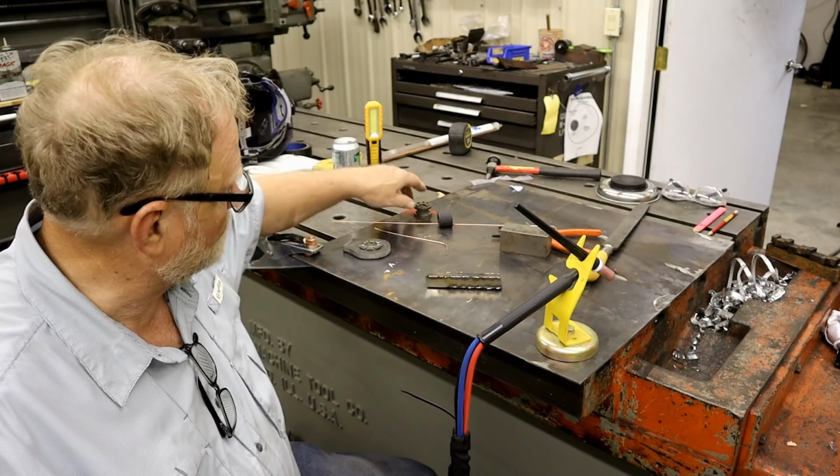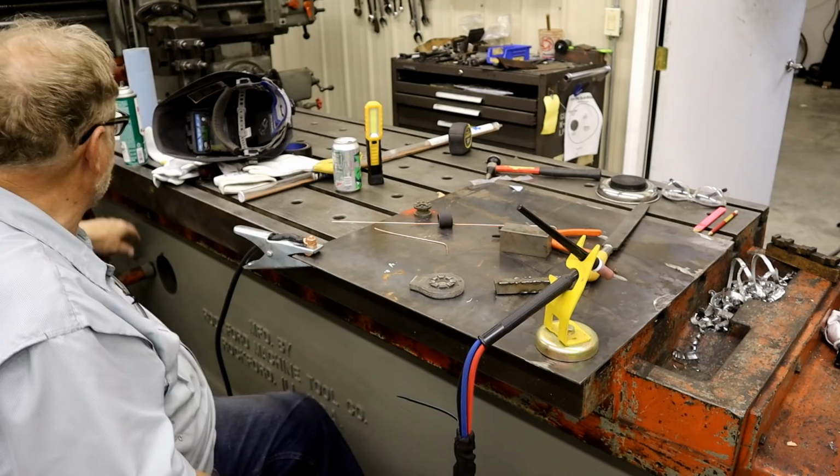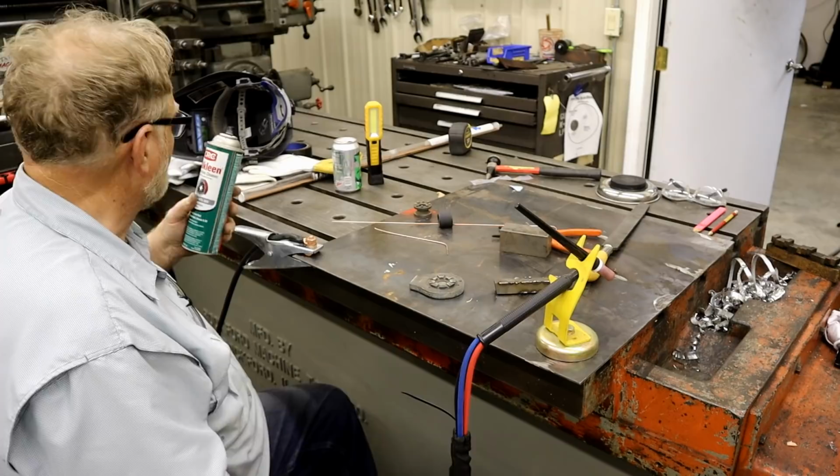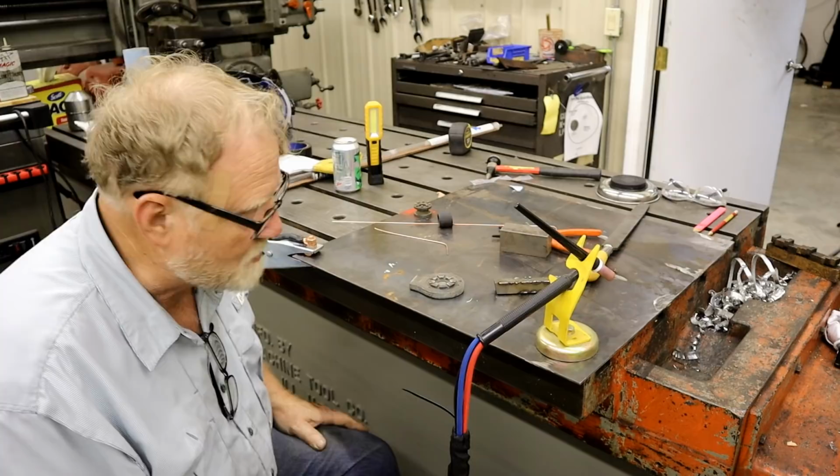Now, I've cleaned this with a brake cleaner, so it's as clean as I can get it. Now remember, if you're welding and you clean something with brake cleaner, get the non-chlorinated kind. You don't want to make gas that will kill you. What is it, phosgene gas? Anyway,